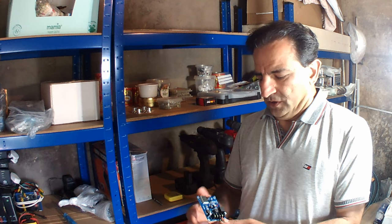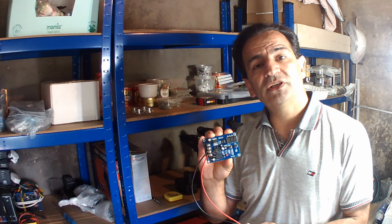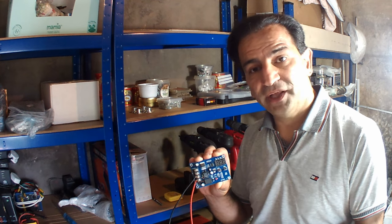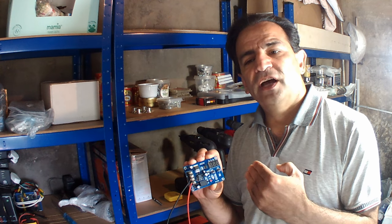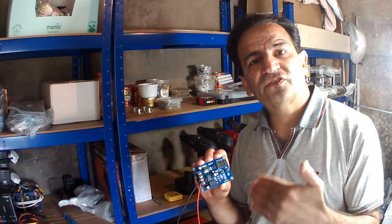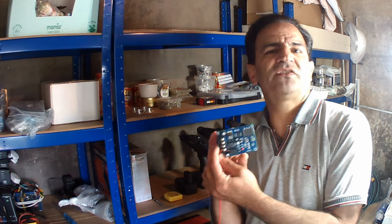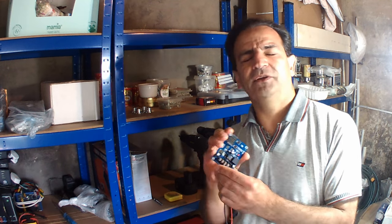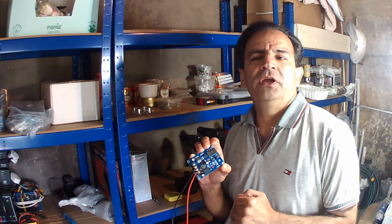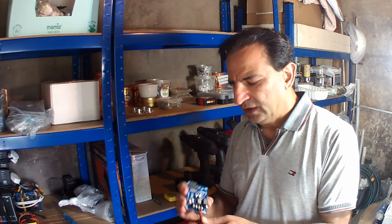This is the regulator battery charger module. It shows you how much voltage your battery currently has, and you can set the maximum voltage you want it charged up to, and the minimum starting voltage at which you want charging to begin. This basically protects your battery — it won't get overcharged and it won't go below the minimum voltage, both of which could damage the battery.